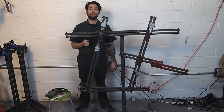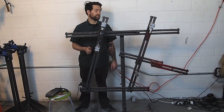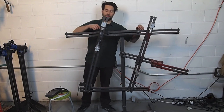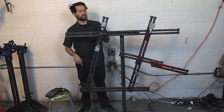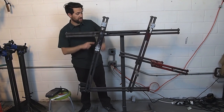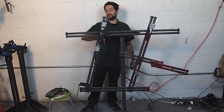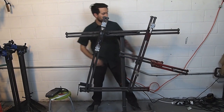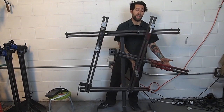The first thing that you're going to do is consult your frame drawing. From that drawing you'll get your seat tube length, your top tube length, the length from the top tube head tube joint to the bottom of your head tube, and the angles between the head tube and top tube, seat tube and top tube, and the relationships for your rear triangle.